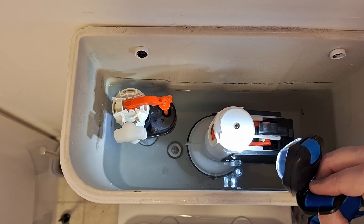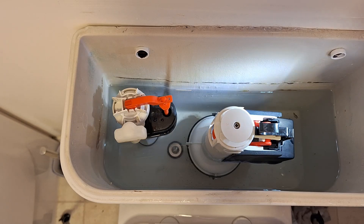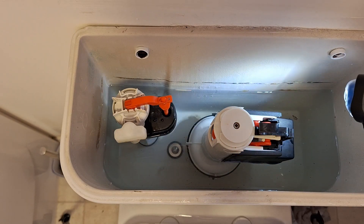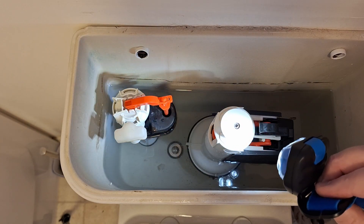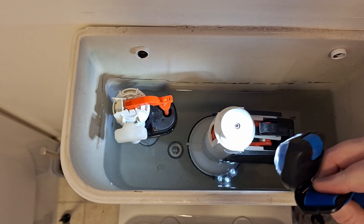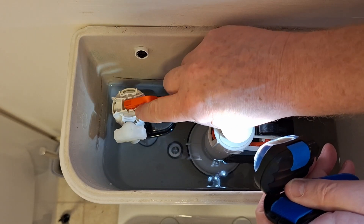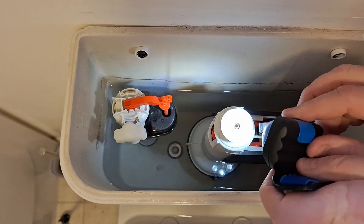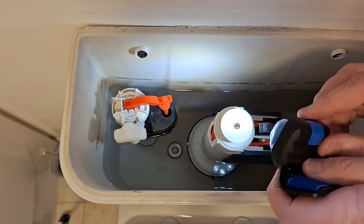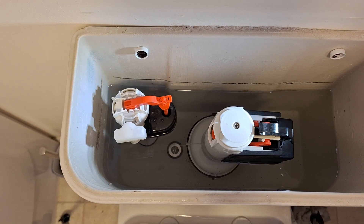The water is now shut off. No dribbles. But just keep an eye on it over a few days to see what happens. You can see it's not coming up to the black line — the float is going to stop that. So just make sure you clean everything properly and dry it off before you put your rubber washers in. Especially the tiny little washer that goes in underneath the arm, and especially the bits that it clicks into — you must get that click when you turn it in order to seal it. It stops dribbling and that will stop your little overflow in the toilet. Thanks for watching, and sorry about the shaky hand but hopefully this will help.